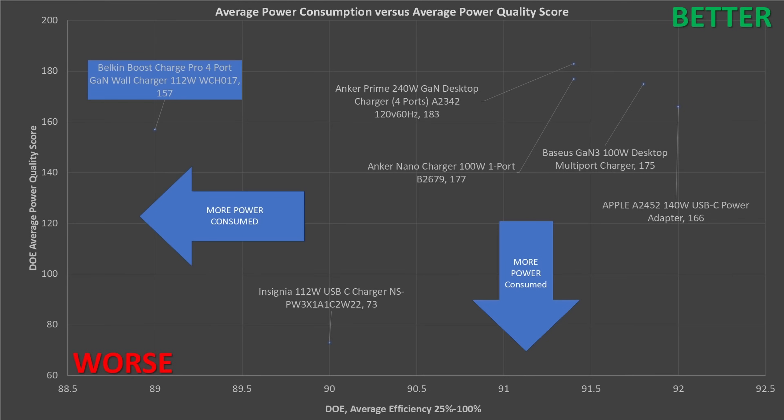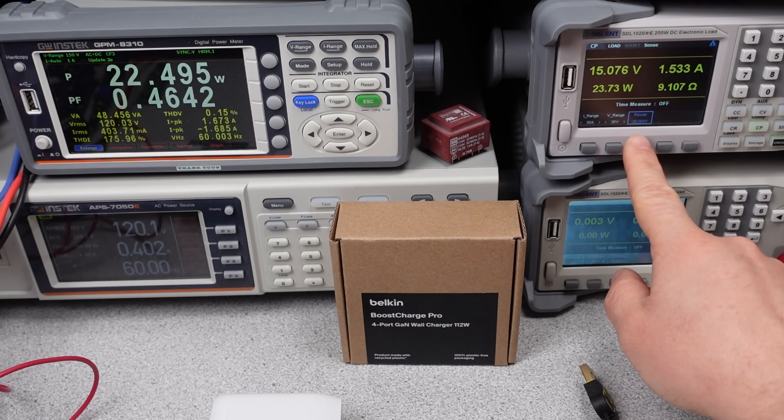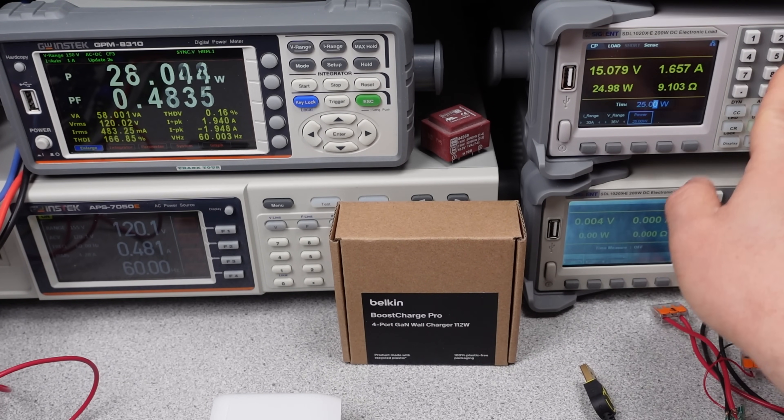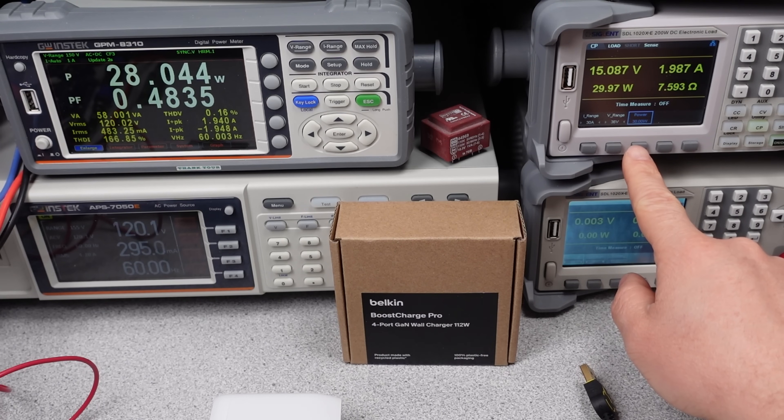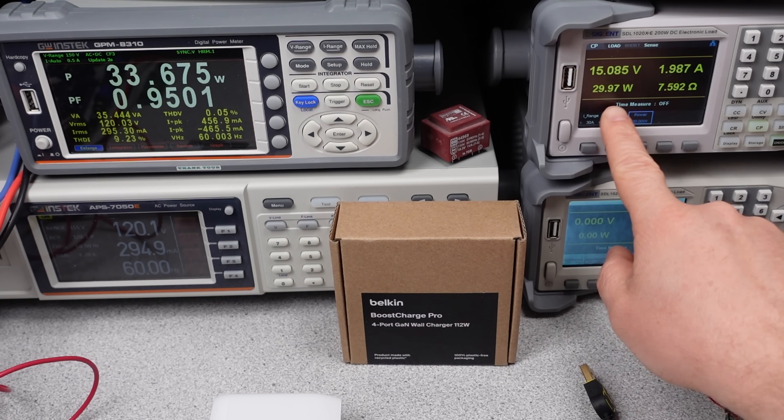The average power consumption graph shows the main issue with this charger. The chargers that have higher efficiency tend to run for longer and operate cooler. It's a small difference, but they all get hot. Being 89% efficient, the Belkin just can't keep up with the competition, and this caused the charger to shut down fairly quickly at 30 minutes of runtime before power off. The Insignia technically is more efficient, but that's a fake number because it lacks power factor correction — it's really worse. In both cases, it's a big gap to the higher efficiency chargers. There are research projects and development kits that can beat all of these, but they aren't real products you can buy.